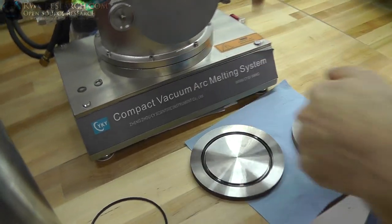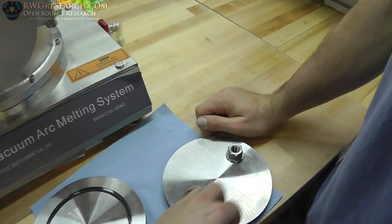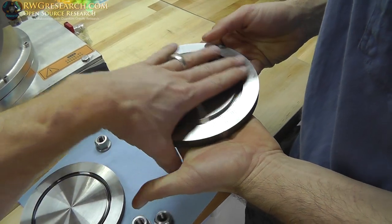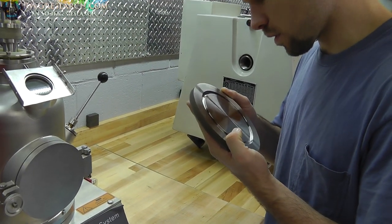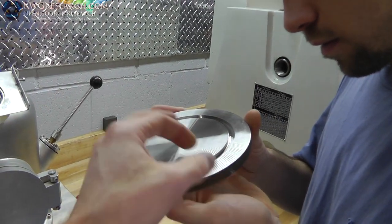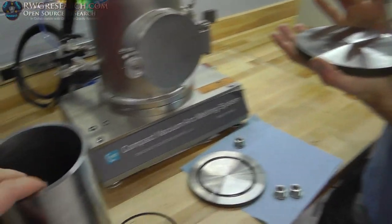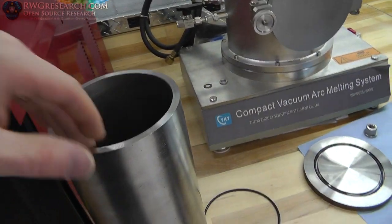So you're going to go with three? Yep, for the flanges. So I machined these. Can't get that one out. We'll look at this one. But I machined these plates and machined the grooves, and they're about as good as they're going to get as far as the inside of those. Taper them a little bit? No, they're flat, but I couldn't get the tools the whole width, so I just did it exactly where it needed to be. That's all I've gotten so far: these edges machined on this tube and polished the best I could inside and out.